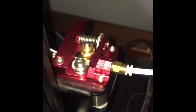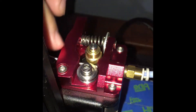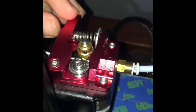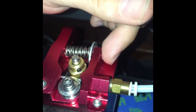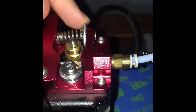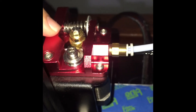Number four, I recommend replacing your extruder tensioner for a couple of reasons. One, this bolt gets too tight on the plastic and eventually starts to lose its strength. The advantage to replacing it is that there's a screw here that pushes all the way through to this CNC part, and you can add washers — which I highly recommend — because even after buying this part for both of my printers, it still was performing poorly and had under extrusion.